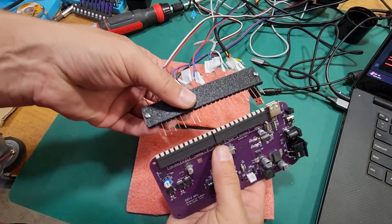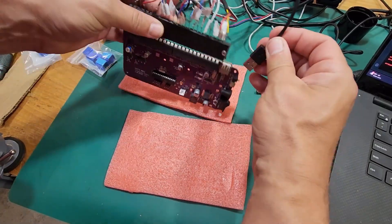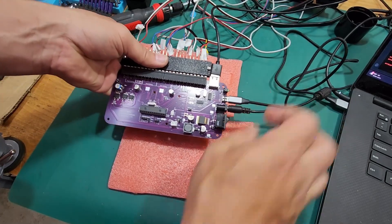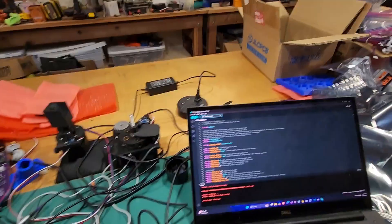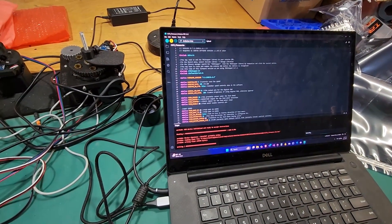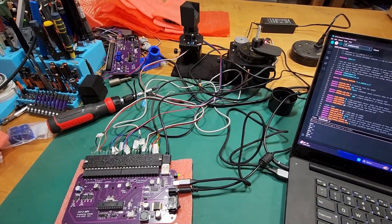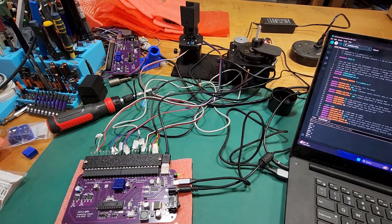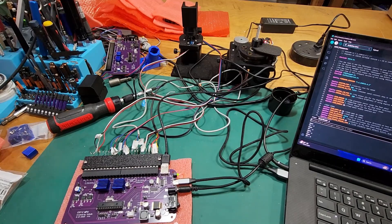This footage shows how I test each and every board. I put together a quick harness using spring wire, tape, and solder — apparently you can't solder to spring wire, but it's quick to connect to the connectors and pops out easily. This allows me to push the latest firmware to the board, and once the firmware is done I kick off a test. While the test runs I go ahead and apply the heat sinks. This tells me that all the motors and all the sensors are working, and I do this for every board I ship.